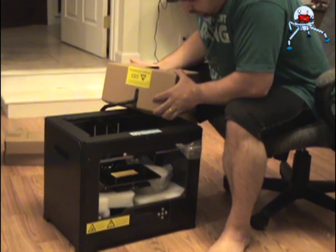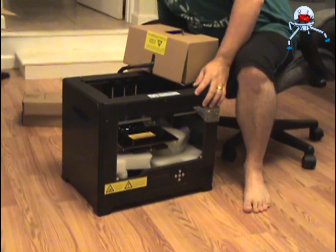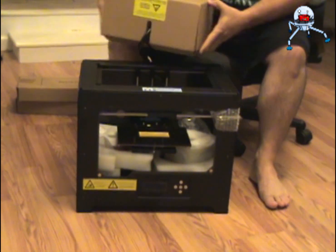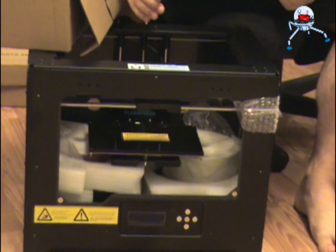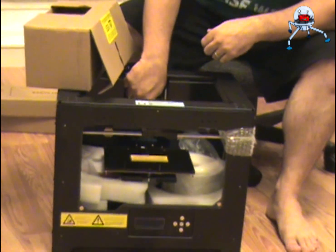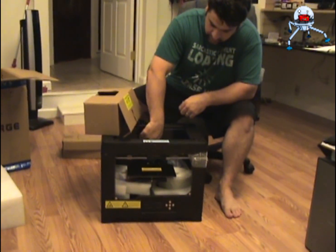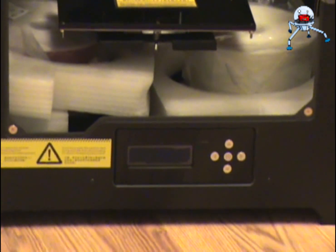What we want to do now is there are two filament pulls. So we want to raise the bed a little bit so that way we can actually pull it out. You have two methods — either rotating the bar or the Z-axis over here manually. You might see the screen actually flickering from the static. We're lifting the bed, which now gives us enough space.